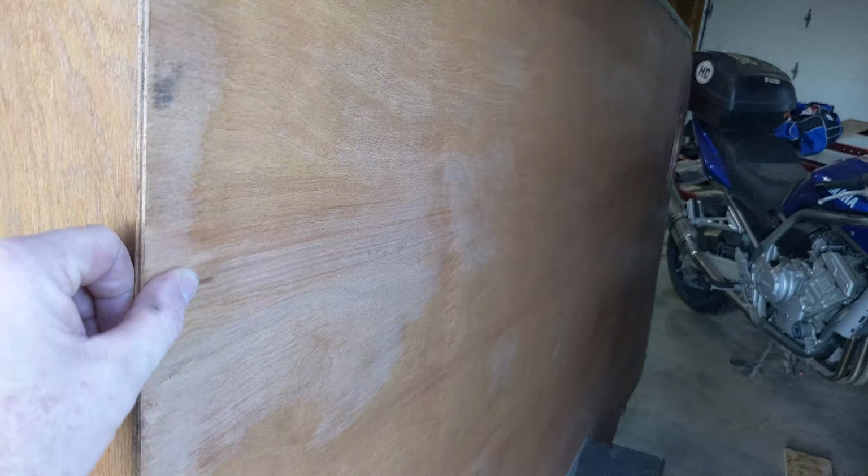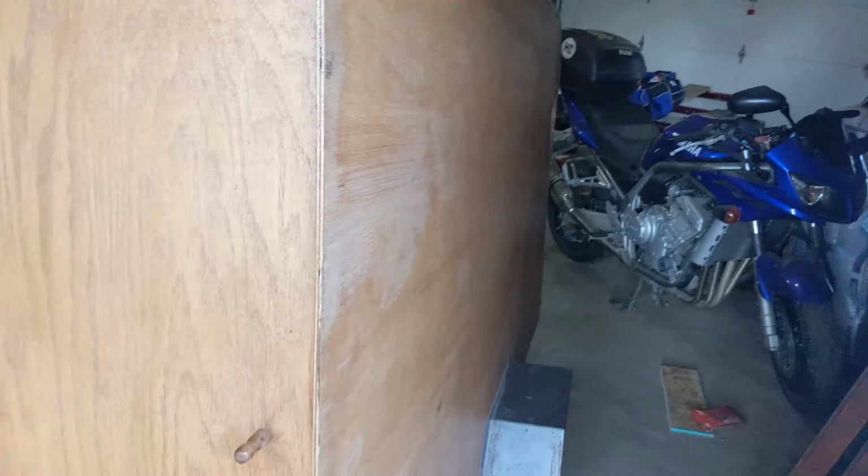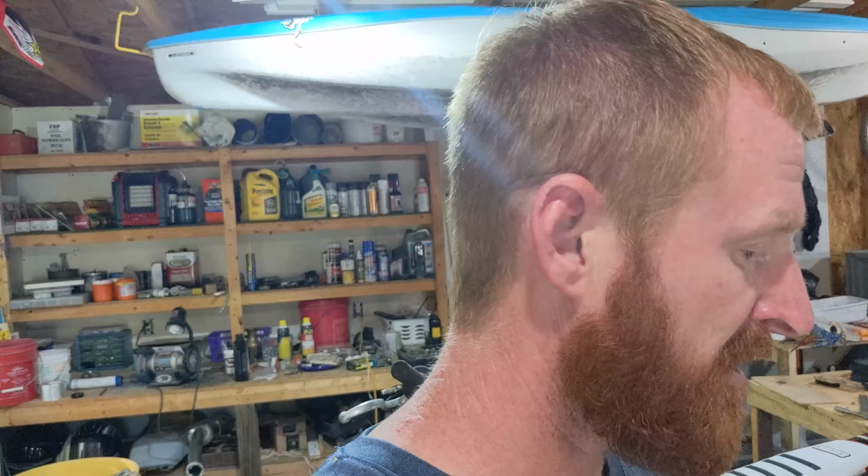One person was concerned about how this wood would hold up after a while. Well, it's holding up really well. I do have a little bit of wear where I might have gone a little light on the stain and seal. I used two coats of Thompson's and then two coats of clear spray paint on it. So you've got four coats, and it's held up well, but the camper sat outside all winter long uncovered, and I pulled it uncovered. I never threw a tarp over it. It's been about 15 months since I built it, and only in the past 2 months has it been out of the elements, and it's held up really well.